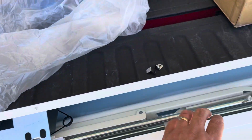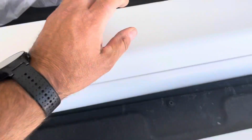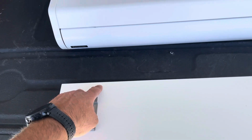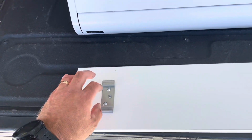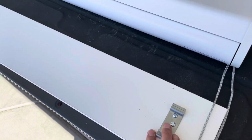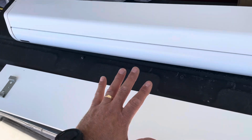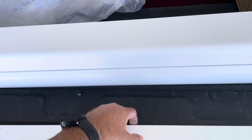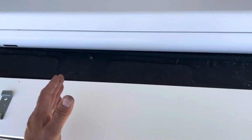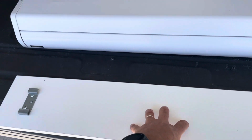So what I've done is I've made a template in Cabinet Vision for this, and it pre-drills a hole for the brackets. Got to adjust it. This one, they came out backwards, but we've pre-drilled where the holes go. The nice thing about this is that they're even on this board, and now we're going to mount this board to the wall, and we can just level it, and that way we can hit studs anywhere across here and still have that securely fastened to the wall.